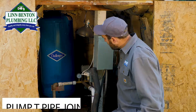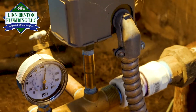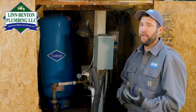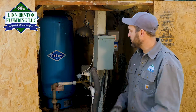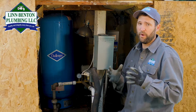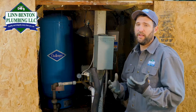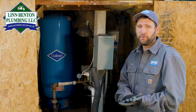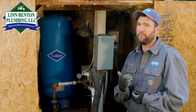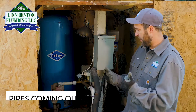The next thing is your pump T, which is this brass thing right here — you can see it's in a T-shape. That's a piece of brass that allows you to plug in all these other components, and it's specifically made for pumps and well houses. The blue tank back here is called your pressure tank. It's a steel tank with a rubber diaphragm inside, and it holds pressure for your system. That enables your pump to not have to run all the time — it stores pressure, turns on when pressure gets low, and turns off when it builds enough pressure.